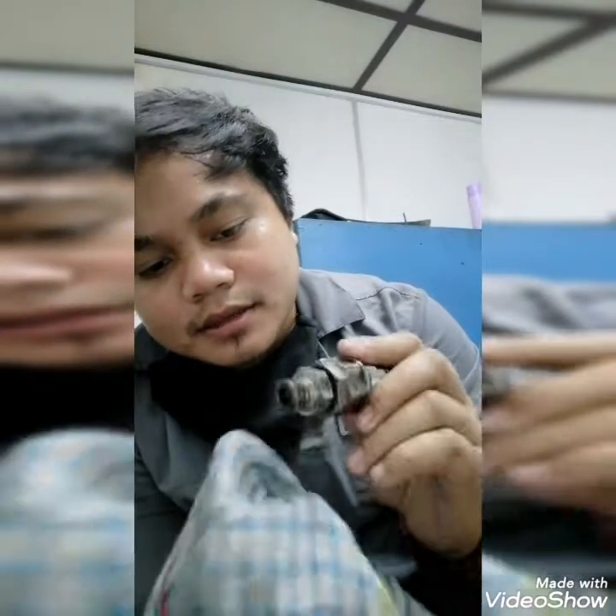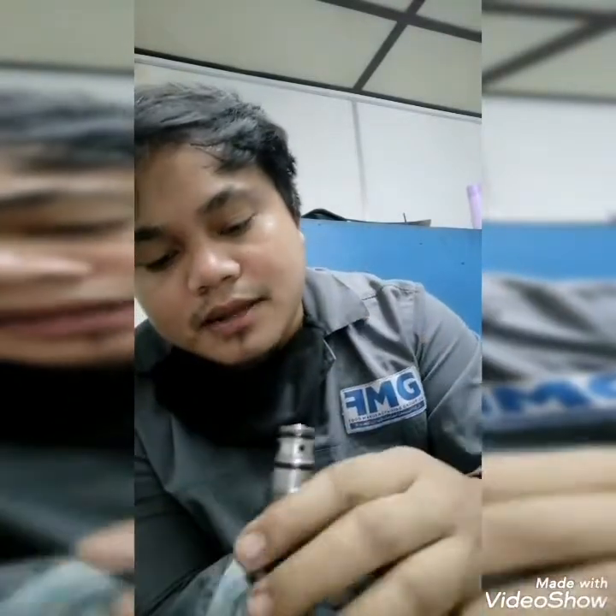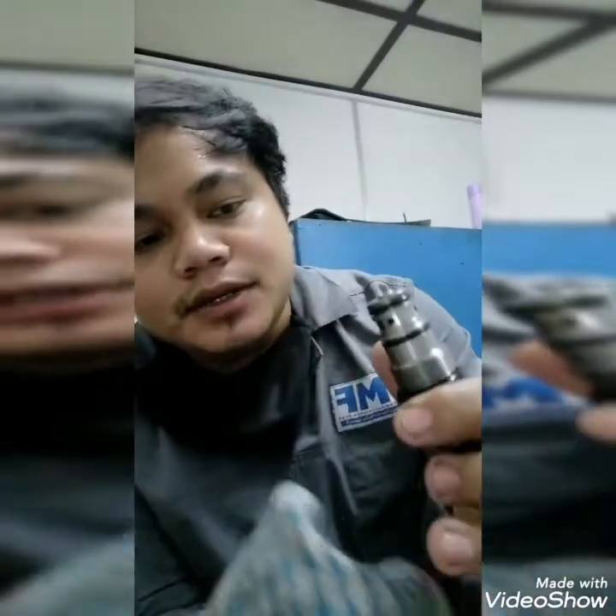So I need to adjust this, because if there's no air pressure coming while I'm blowing, it means that the oil will also not come into the valves. You need to make sure that oil will flow during your testing. You need to apply pressure so that if there is a passageway, the oil can also pass. There's no flow, so I need to adjust until you reach the point that you can already blow with pressure through.